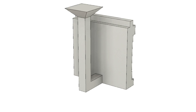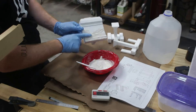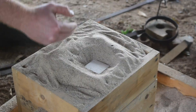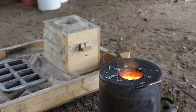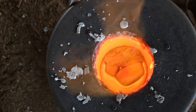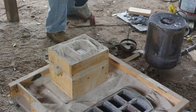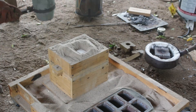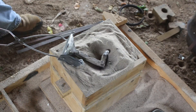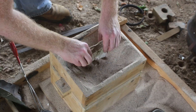I'm really happy with how it turned out. The first thing I did, as usual, is I prepared a lost foam pattern. This is a pattern of foam pieces assembled using spray adhesive. I sand it down to give it a nice finish and then coat it with plaster of Paris. I embed that pattern into a sand bed where I can pour molten aluminum onto the foam. It vaporizes the foam and displaces those gases out into the sand, leaving a frozen aluminum piece that matches the shape of the polystyrene pattern.